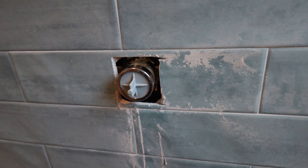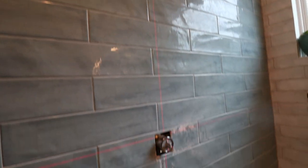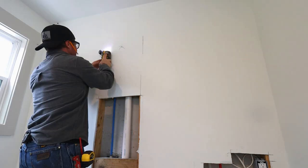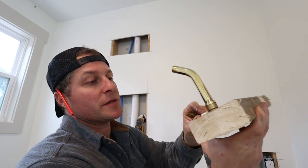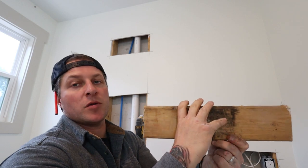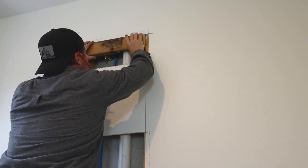This is what the valve looks like installed on the shower side. Now I'm going to put my laser level back up, measure my height for the shower head hole, drill that, and get that installed the same way. Since I drilled the hole from the tile shower out, I'm going to mount this to my crippling piece of wood so I can line it up with the hole perfectly, slide it through, and screw it to the 2x4 wall studs right where it sits. I left the bottom hanging out so when it's lined up we can connect the PEX and still have room to crimp it from the bottom side.